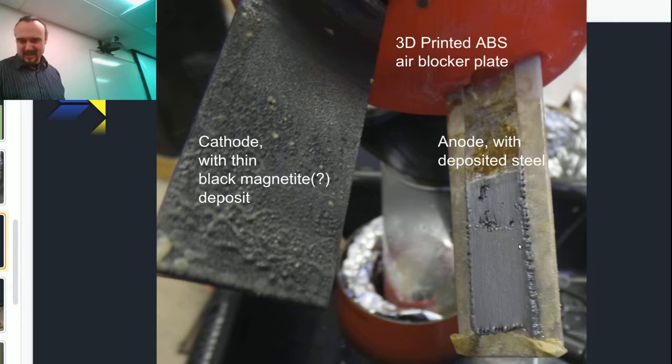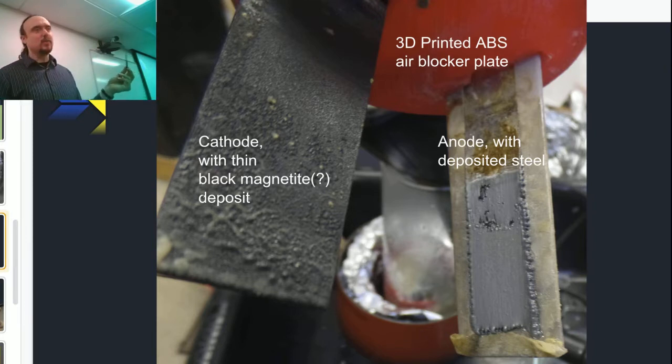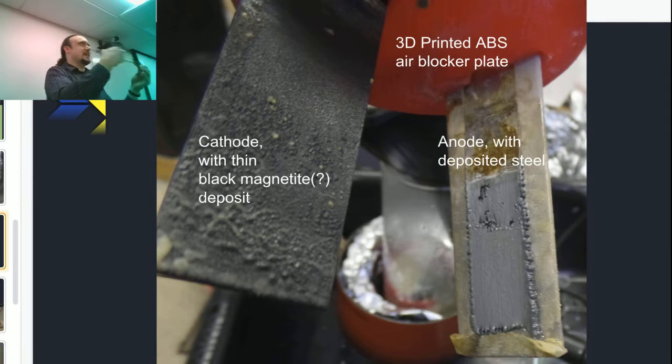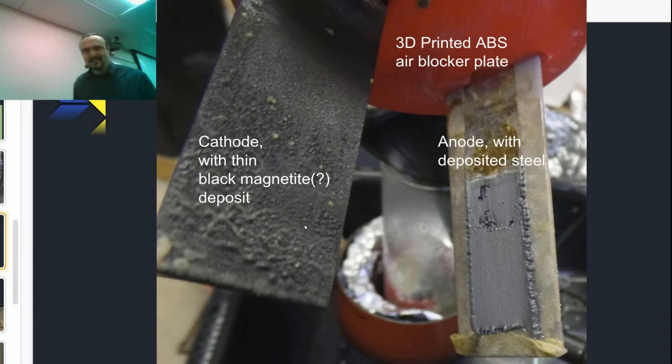This is the anode, that is the cathode — that is the positive terminal, that's the negative terminal. And I literally do grow a little layer of steel on there. This is the only piece of steel that I made, which I immediately tested — did some chemical analysis, some mechanical tests. This piece doesn't exist anymore, which is frustrating. I also have this, which I electrodeposited with basically a steel anode — rather than cracking the atoms out of basalt, I was starting from scrap steel. You can totally electrodeposit these things — I'll pass this around. It's definitely doable. Hydrogen evolution is competing with the deposition of the steel, so my current efficiency is actually pretty bad — I think it was 30%.